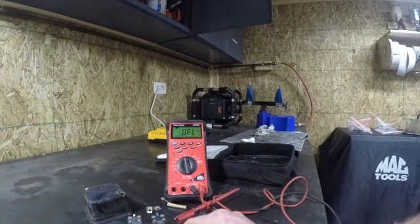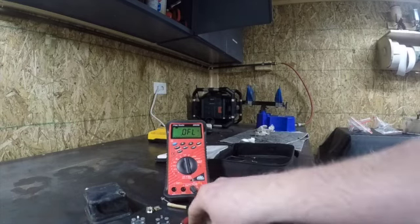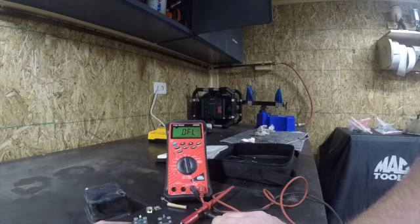On a car voltage regulator, you would have another set of points over here. This would be bigger. You'd have another set of points over here. Usually cars were both voltage and current sensitive, but we're not going to get into that because this video is all about your old tractor generator, and you don't see those a whole lot on tractors.